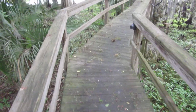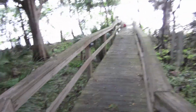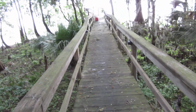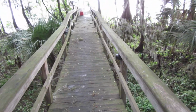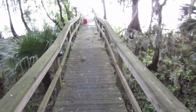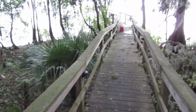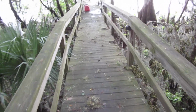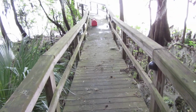wood. Of course, you definitely want to use a water-based stain. Stay away from oil-based stains and sealers in the state of Florida. They're not meant for the state of Florida. I can't reiterate that enough. They're illegal to use on our Florida waterways. They don't hold up at all to this brutal sun here in Florida.